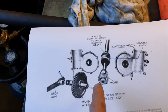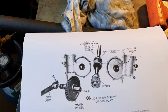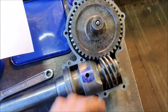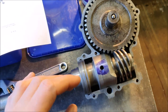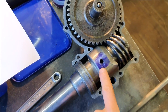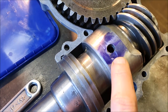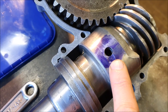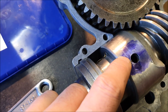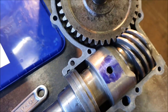They call this the eccentric sleeve — this is the diagram here. Because it's called eccentric, it makes me wonder if it's slightly off-centre and that's giving you some sort of adjustment, but it doesn't look like it. I can't see that there's any adjustment there. You can see here where the screw has never locked into the hole and you can see where people have just tightened it up onto the housing. I blued it and you can sort of see the little line I traced which shows how off-centre this hole is.